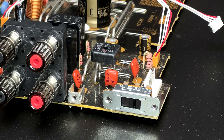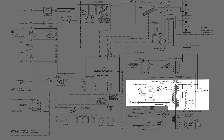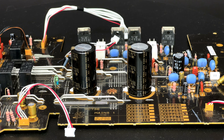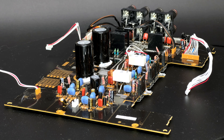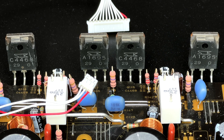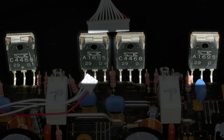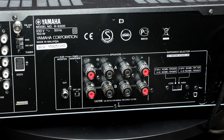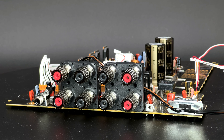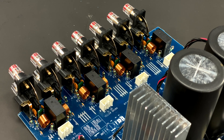Another curious thing is this impedance selector switch — depending on your speakers it switches between different configurations of secondary windings of the transformer. As this is only a 50W per channel amplifier, the capacitors are not too impressive; each of them has a capacitance of 5600μF. Output transistors used here are Sanken Electric C4468 and A1695 — NPN triple diffused planar and PNP epitaxial planar transistors. It is possible to wire two sets of speakers to this stereo receiver. Surprisingly, these binding posts are very well made — not much worse than my 7-channel Marantz MM8077.